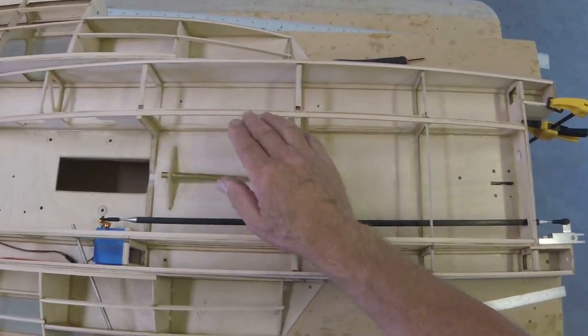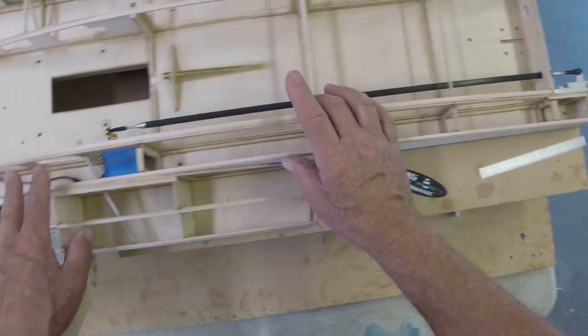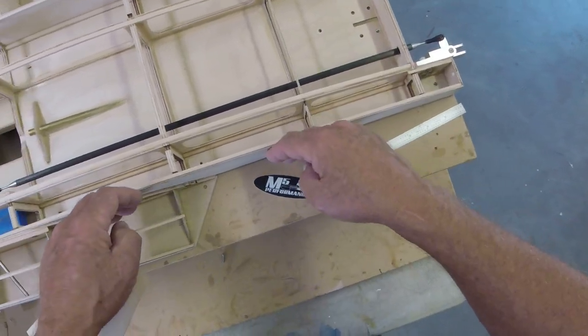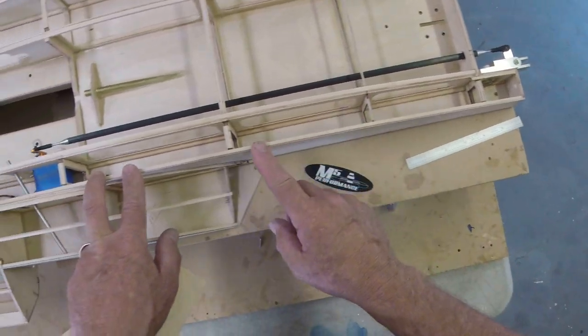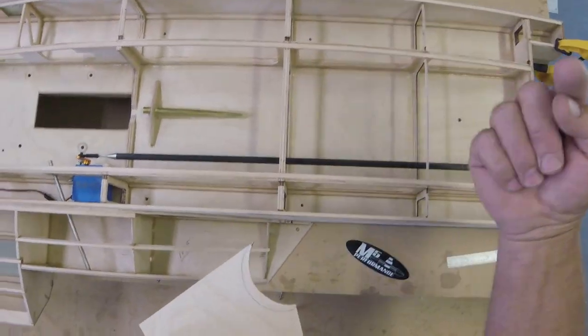Pre-build your piece really nice and straight for a couple of reasons. It'll save sanding later. So try to make it fit really nice, even here out to the edge. Boy, just make it come right to the edge. Go ahead and just finish it now. If you overhang it, don't leave yourself an eighth of an inch thinking, well, I need to leave a lot of room. Nah, you'll go crazy sanding it, and then you'll accidentally sand other surfaces, and you'll have made your boat ugly. Don't build ugly boats.